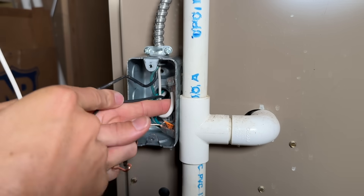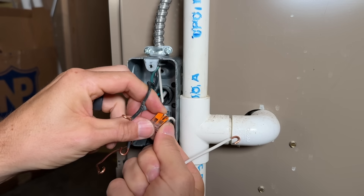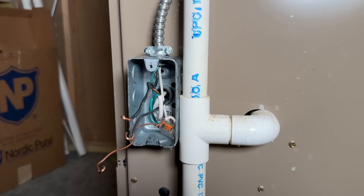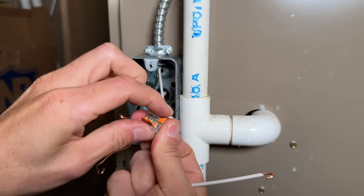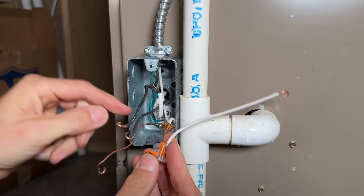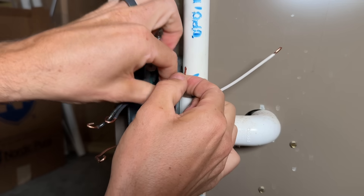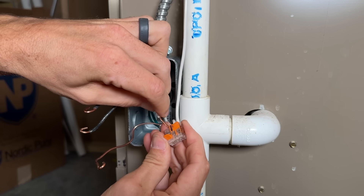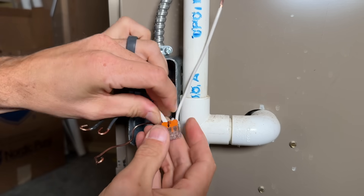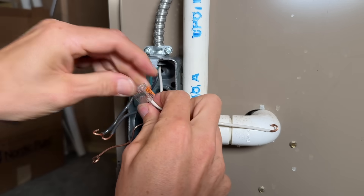The only tweak needed to the wiring is on the neutral side — we now have an outlet, so we need to provide a neutral to it. This is also where WAGO lever nuts shine: I can reuse the two-pin, put it in the box, then swap to a three-pin and add a pigtail. Because the wires go straight in and aren't damaged, you can reuse them without re-stripping. Use the transparent housing to confirm all wires are fully seated, then do a pull test.